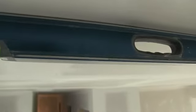And there we have it. You can see the difference from a conventional butt joint on the wall compared to butt joints finished with Butt Board on the ceilings, which are one third the size. This saves on labor and saves on material.